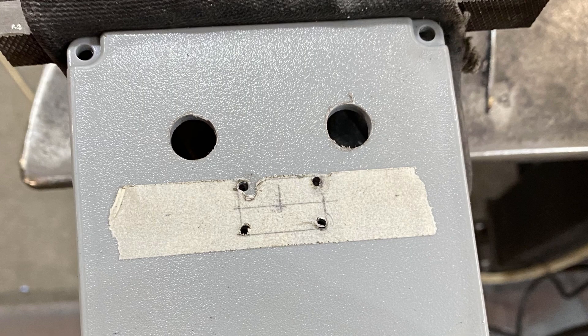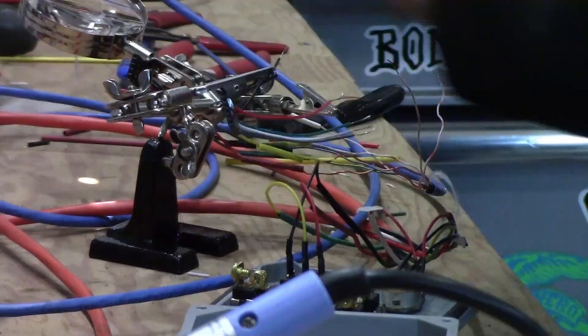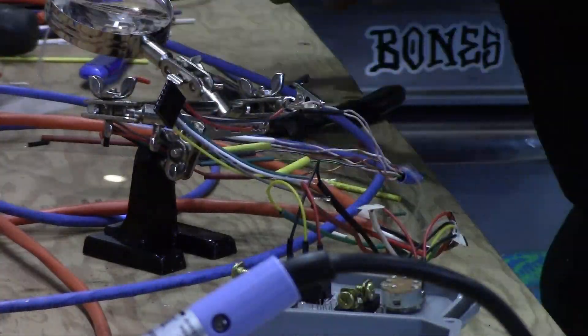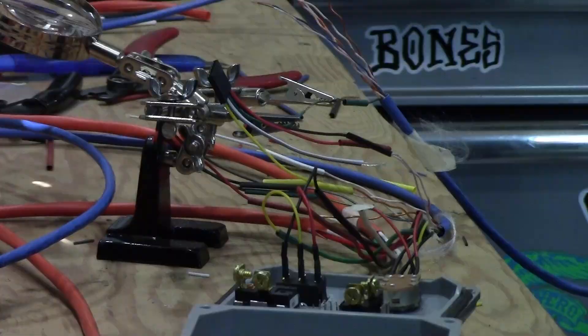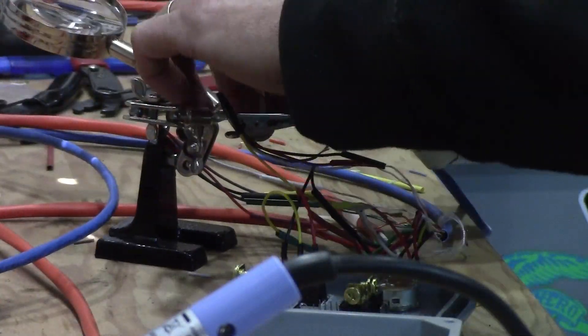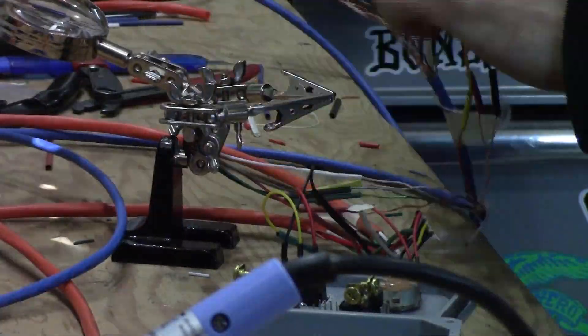Here's my remote control box, which is just a plastic conduit junction box from Home Depot. The upper round holes are for the on-off switches, the middle rectangular holes for the LED display, and the bottom ones are for the forward-reverse switch and the speed control dial. I could have left all the wires intact and just installed the controls in the main housing, but I wanted a remote control so I could get close to the action and make adjustments on the fly. There were so many connections I had to use two lengths of Cat5 cable and two lengths of speaker wire — that's a tedious amount of cutting, stripping, soldering, and heat shrinking.